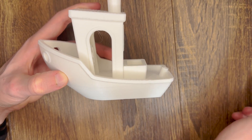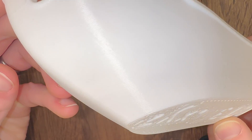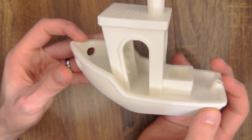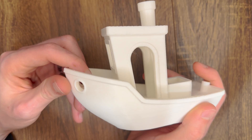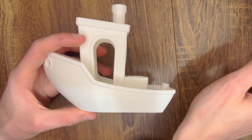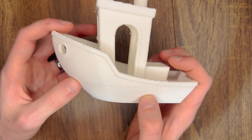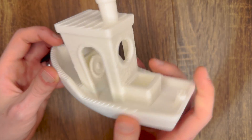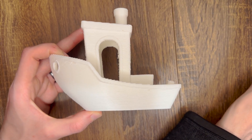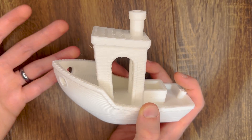This big Benchie — a 300% scale — was made using the 0.8 millimeter nozzle, and I think it's my favorite of the bunch. The hull is very clean with no resonance, no fish scaling, and very little horizontal artifacts. It offers a good compromise between quality and print speed, taking only two hours for a 300% Benchie. Then this next one was made using a 1 millimeter nozzle at a 0.8 layer height — it's really bad quality, but it only took 45 minutes to print. So if you want a functional part that doesn't have to look good but is enormous, that's a useful setting.